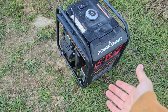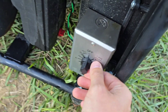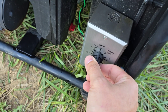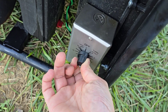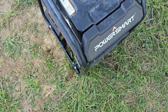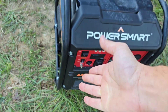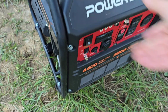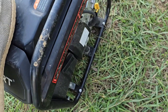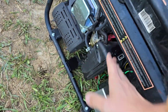Time for the moment of truth — let's see if our hard work paid off and if we can time how long our generator runs. You have to turn the mechanical timer past an hour for it to work, so if you want to set it to exactly one hour, turn it to about four hours first, then turn it back to one hour. Also, the original on/off switch on the front no longer works, which makes sense — if the timer is in the off position that switch won't work anyway, so just do everything with the timer switch from now on.